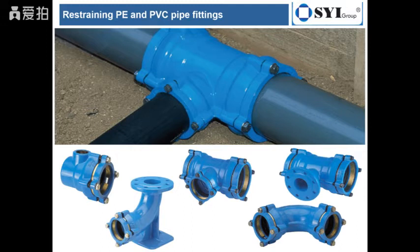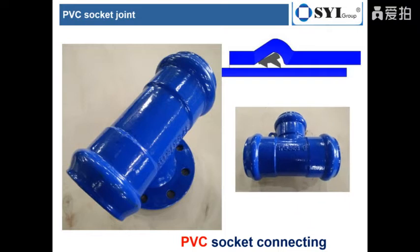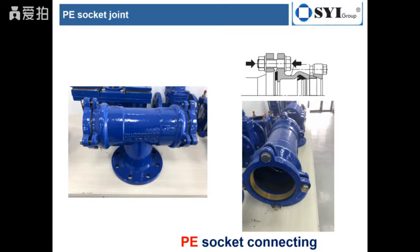For this series of pipe fittings, we have the all socket T, and also different degree bends. Also we have the socket T with flange branch, the duck foot, and the end cap. From the picture you can see the PVC pipe fittings connect with only a gasket to connect with the pipe and avoid leaking from the pipe. This is only for PVC pipe. But after adding a gland and also a brass ring, the socket can connect with the PE pipe.